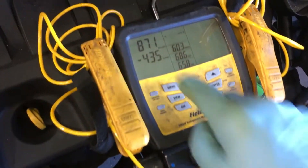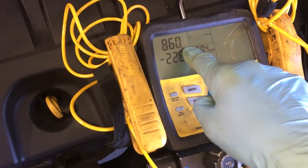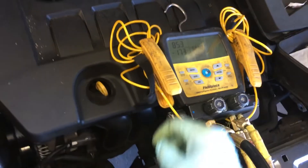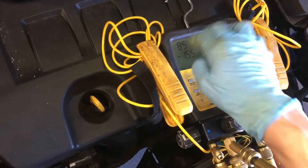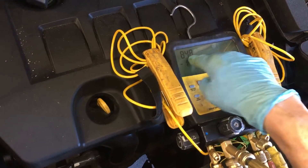You can see I don't have nitrogen in the system — I pulled a vacuum on this yesterday and it's still holding 862 microns from my last job. This is the next morning at my first recovery job of the day, and my gauges were able to hold that vacuum overnight.